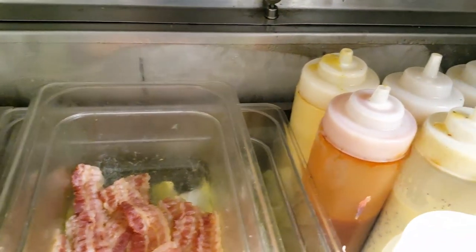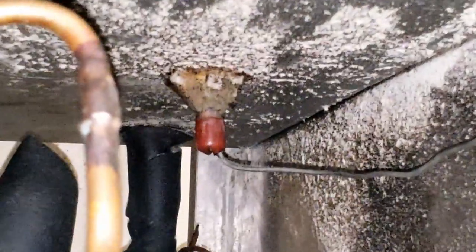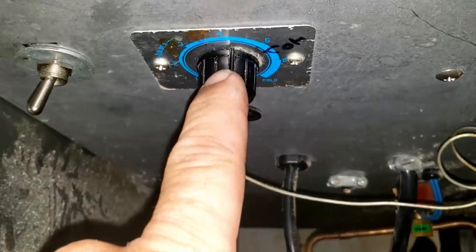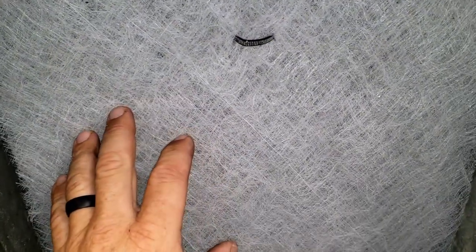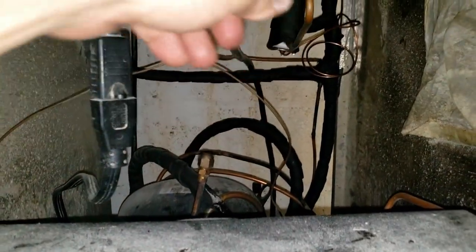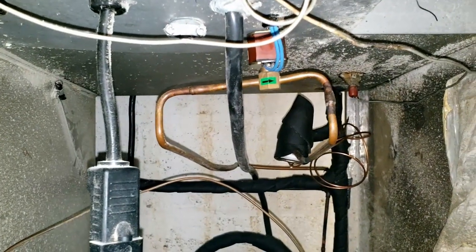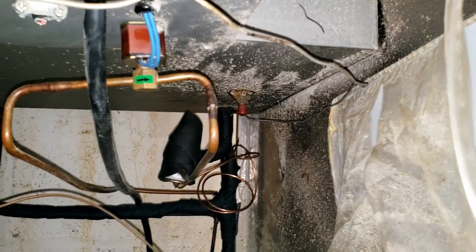Our top rail is now starting to freeze like it should. What we basically did was adjust the thermostat probe and remove that fan unit. The product's a little warm so they're going to pull that out to the walk-in until it brings it back down to temperature. The biggest thing I thought was interesting is they wanted you to just pull that probe out until you can regulate it. You can see where the wiring went to the fan on the back side. The on/off switch is still the same. Got a new filter media on there because they're doing pizza here, so there's a lot of flour and powder dust. It cycled off once and came back on, so it is regulating temperature. I'm still going to recommend we replace that thermostat, and when we come back we can double-check anything else.